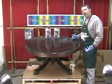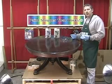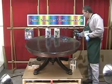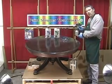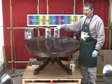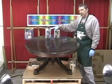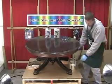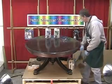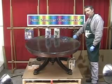Hello, welcome to another part of our video. During this segment, we're going to be showing you the spray application of Star 10 paint stripper. You're going to be using a conventional cup gun. You'll be taking our paste and our liquid, using a 50-50 ratio. Stir it well in a bucket, put it back into our can here, and you're going to be ready to spray.